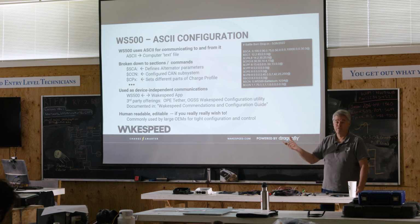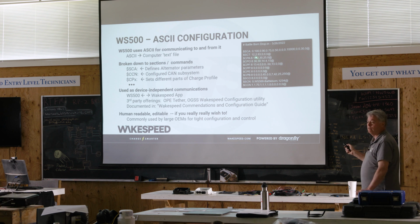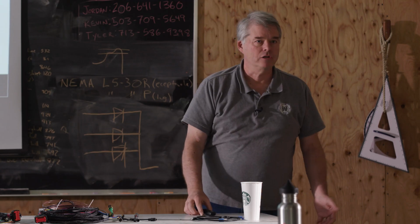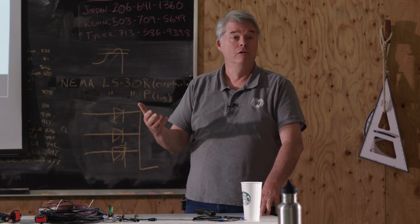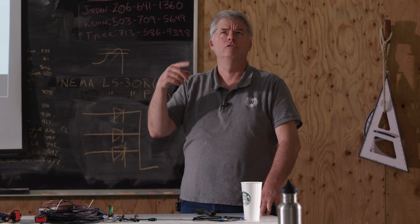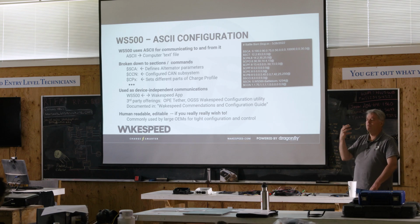So if you're in a 48-volt environment, all of these numbers you define here will get multiplied by 4. Like if we were in a 24-volt battery, we would actually charge toward 28.4 volts. We apply 2.0. Same with battery capacity. It's, by the way, why you can support a 32-volt vessel, because the multiplier is 2.333, I think. So you can apply these multipliers and it makes it a very flexible product.